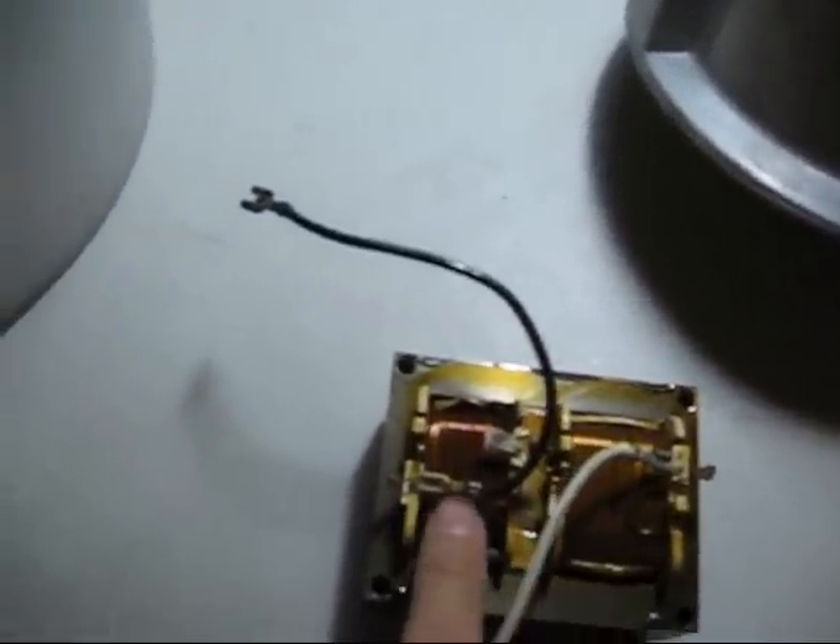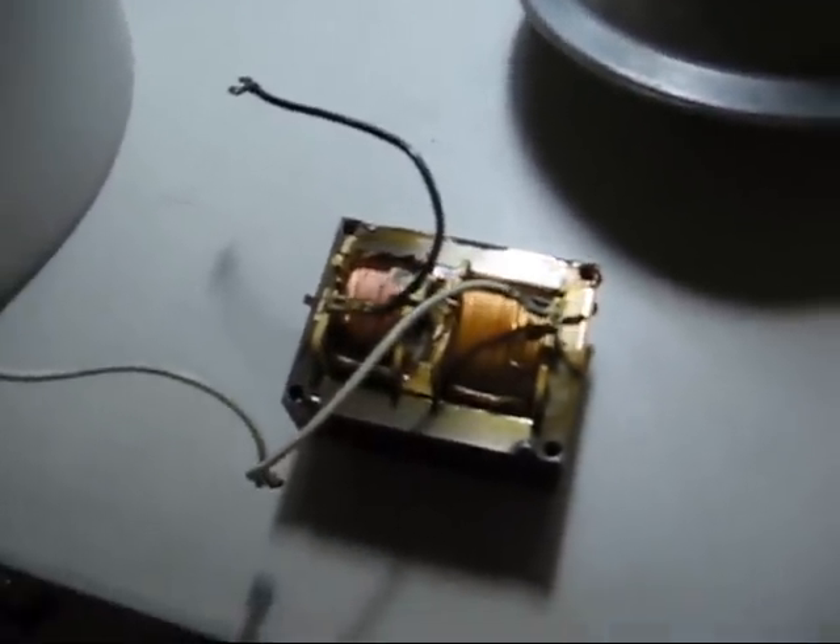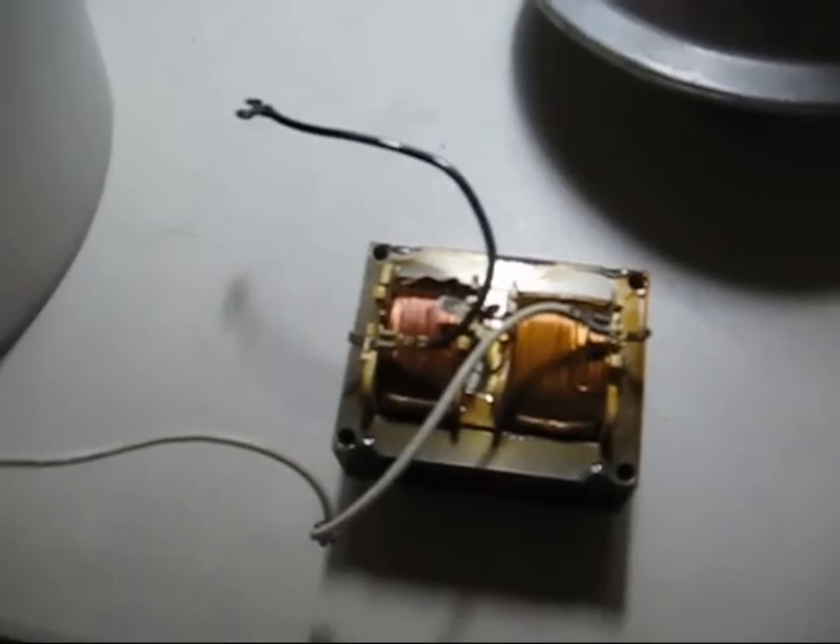This fixture has been outside my uncle's garage slash auto repair shop for many years. The ballast that was in it — I already took it out — developed a noisy secondary winding. Whenever this thing was operating, it made a loud buzzing sound and you could pretty much use it as a buzzer.